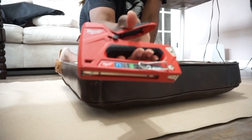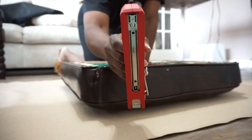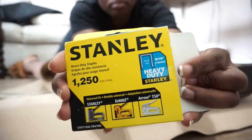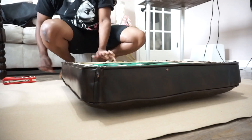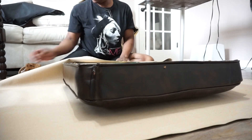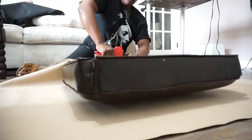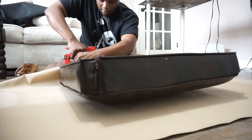The tool that I'm going to use is a staple gun — this one here is made by Milwaukee. These are the staples I'm using: heavy-duty staples made by Stanley. I believe they are nine-sixteenths. My staple gun does use different sizes, so whatever staple gun you use, it's good to get one that is used for multiple size staples. These heavy-duty ones are longer so they go deeper into the wood. The first thing I'm doing is pulling up the sides and starting to staple along the sides first.